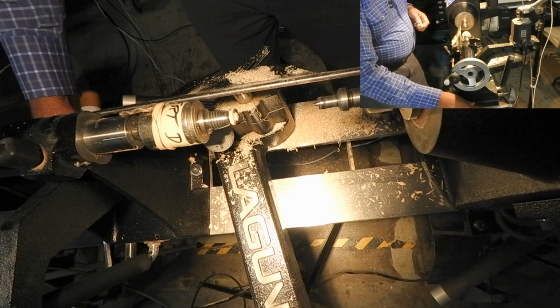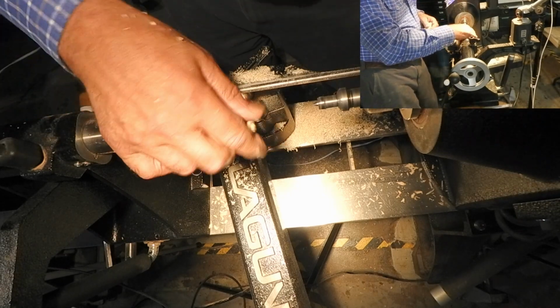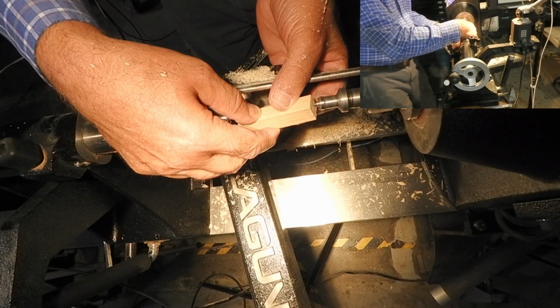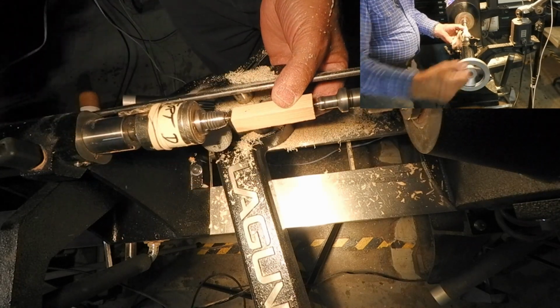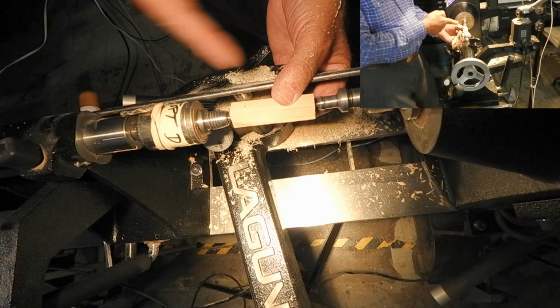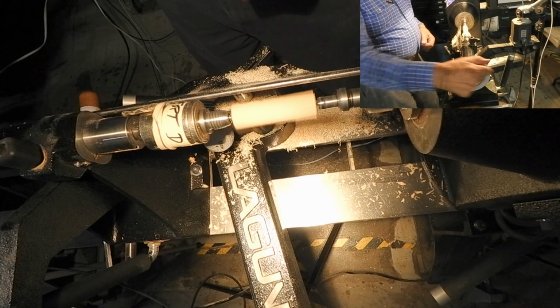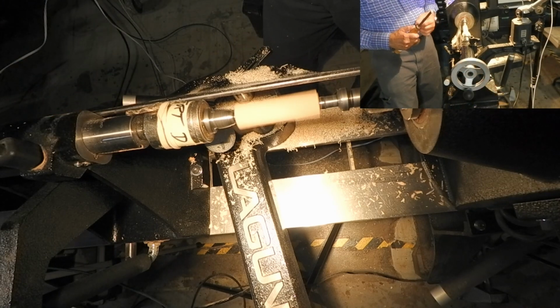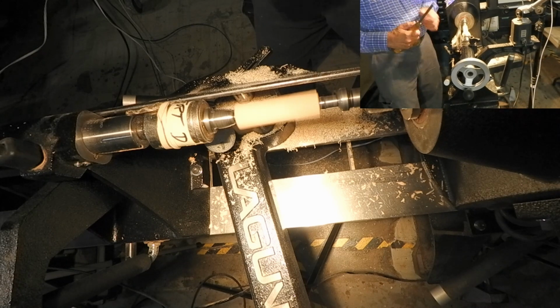And like I said, the part I like about using a stebcenter is you can set it on the point and it doesn't drive the wood until you put some pressure on it. So it's between the two points, so it can't go anywhere. When you let go, it's spinning. So when I was doing 25 or 30 at a time, I could just count down through without stopping.